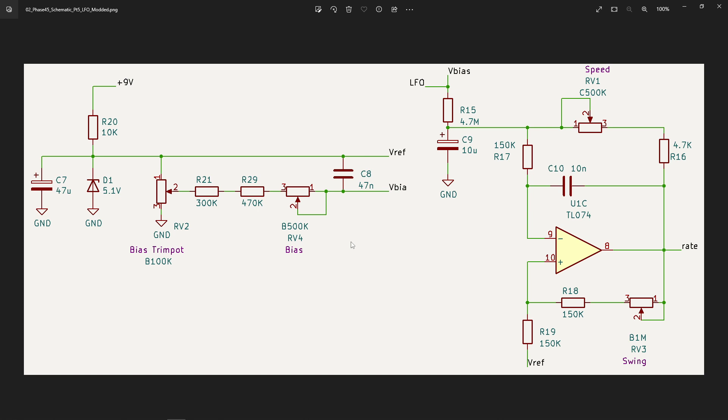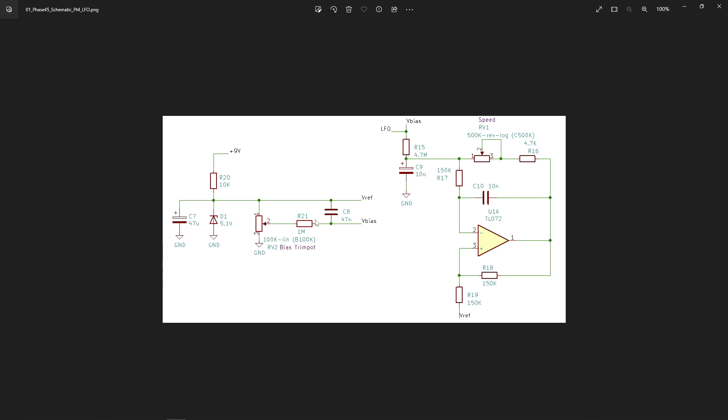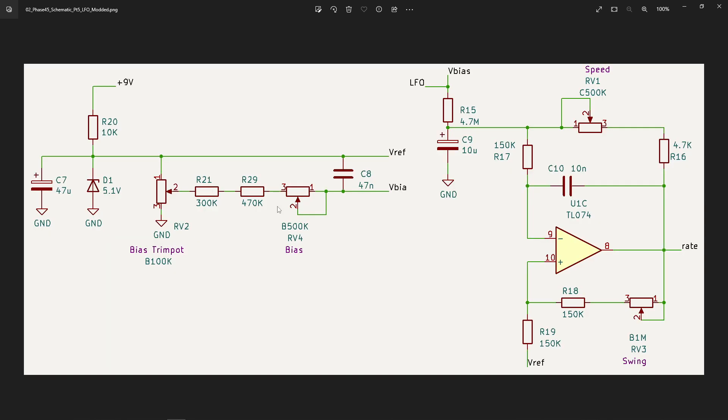As usual, all the diagrams are on my website — the link is in the description. I wanted a 770k resistor here; if you remember there's a 1 Meg here, so this gives me a bit more control — right from 770k all the way to 1250k. This gives me more biasing options and will help me control in the range of 200 millivolts. I set up the biasing point coarsely with this and put it on as a control knob so we can control it a bit better.